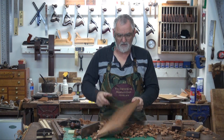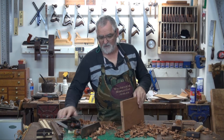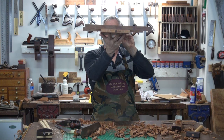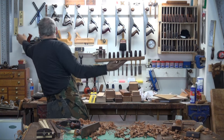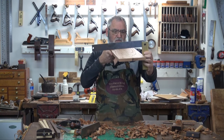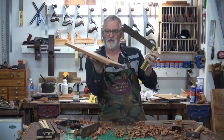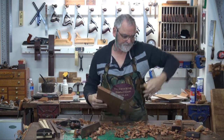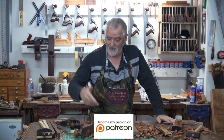It's 3 quarters of an inch — 3 quarters all the way around. Make sure it's square, which it is. Double check that, make sure it's square to both ends, which it is. So if you haven't got any machines, you don't have any excuses — a couple of hand planes and you can flatten boards and dimension them to size.